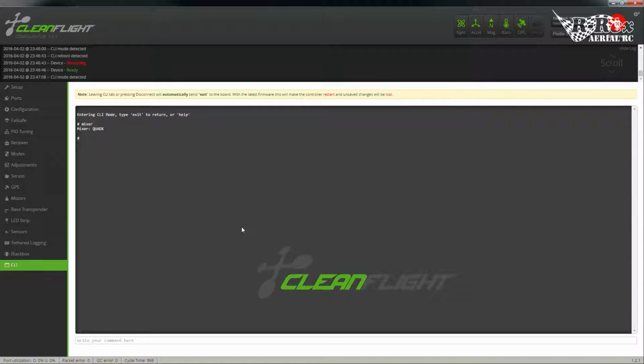Now for you to make any changes and do your own custom mixing, you're going to need to actually select one of the custom profiles. So to get a list of the available profiles, just simply type in mixer space list. Okay, so that's going to bring up a whole series of profiles that are available to you. The one that we really want is custom plane. So to set that, type in mixer custom airplane. There you go.